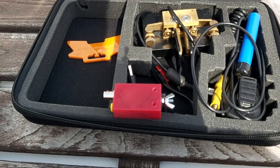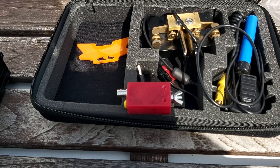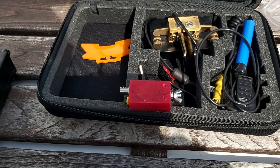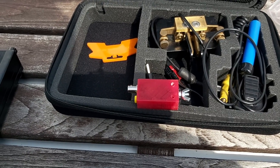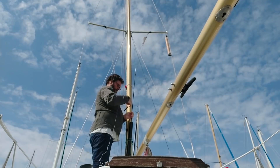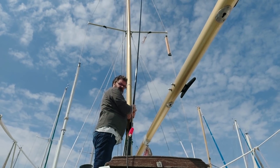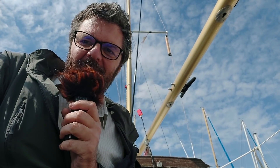I'm using my 64-to-1 transformer — you can see the red box. I'll start with the 64-to-1. I also brought a 49-to-1 with fewer turns. The 64-to-1 has three turns primary, 24 turns total. The 49-to-1 has two turns primary, 14 turns total if I'm not mistaken. More turns is better for the lower bands, and that's better for generally higher bands.